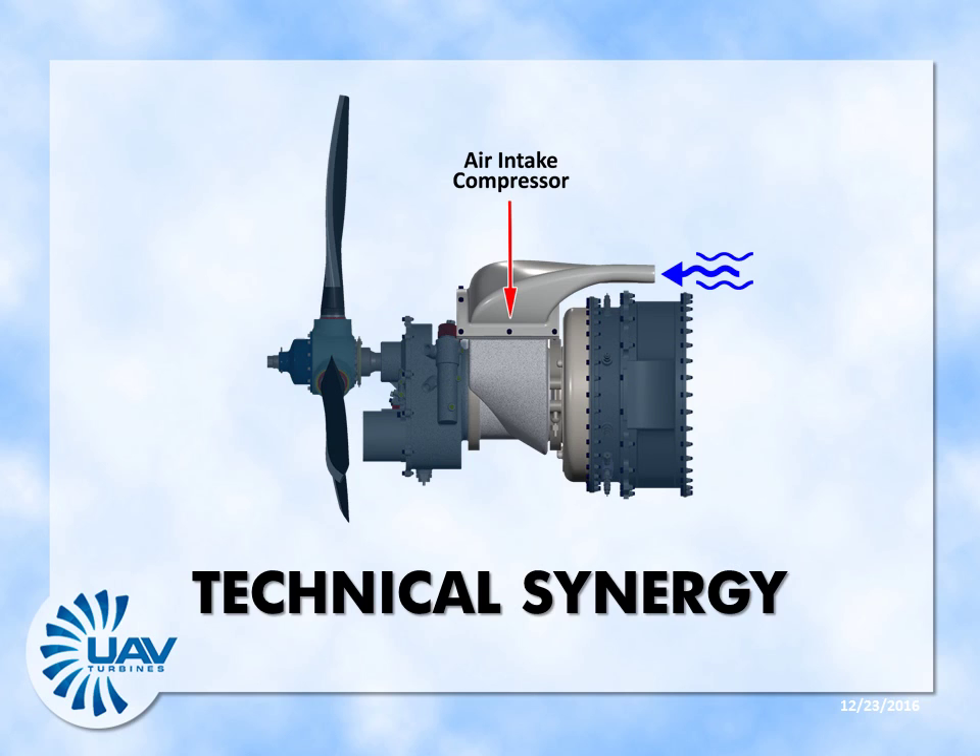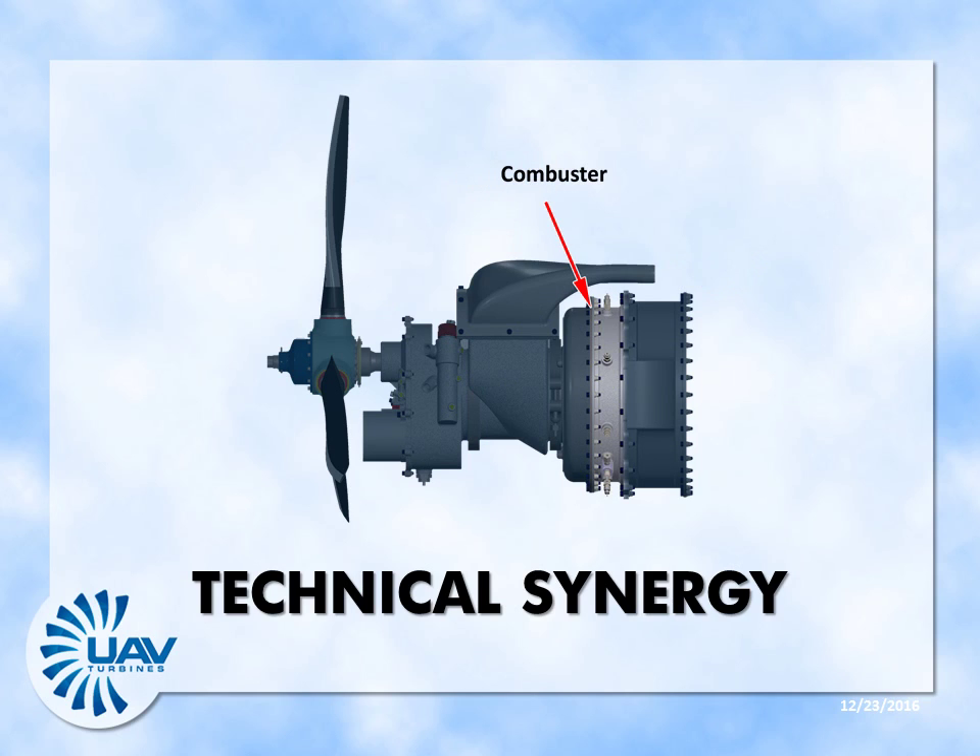The intake sucks in air, filters it, and feeds it to the compressor. The combustor burns the compressed air-fuel mixture at very high temperature, turning the turbine at high RPM and converting energy in the expanding gases to shaft power to drive the compressor and generator, with most power going to the prop. The gearbox reduces the very high speed of the turbine shaft to a speed usable by the propeller, which is a variable pitch prop designed by UAVT for operation in dusty, sandy conditions while optimizing performance and efficiency. A specially designed heat exchanger recovers heat energy from the exhaust and recycles it to preheat air entering the combustor, increasing fuel efficiency.